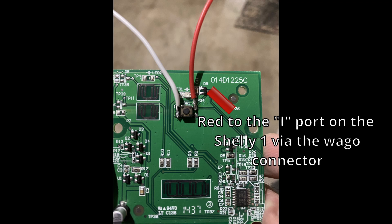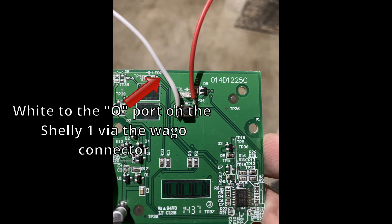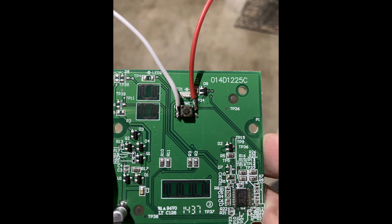So please only do this at your own risk. What I did was I put both of the wires in an alligator clip one at a time, put some flux fluid on the wires, and then grabbed some solder and pre-soldered the wires. Then I melted the solder at the top right corner and let it cool a little bit. I came back in with that wire set on top of it, brought my soldering iron in and set it down on the wire and the connection at the same time until both melted, then picked up really quickly trying not to overheat the board or the components. I did the same thing on the left side. Really it's just taking your time, using alligator clips to hold things in place, and doing it correctly.